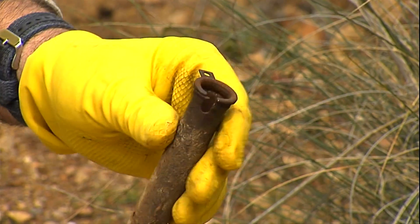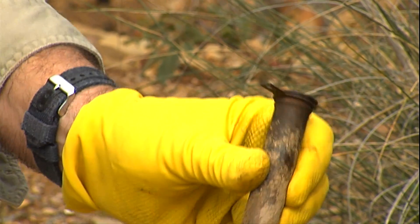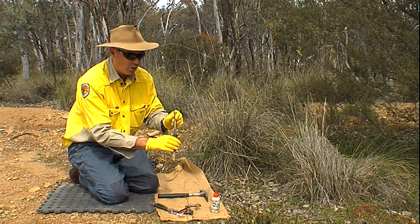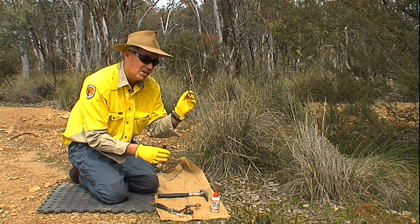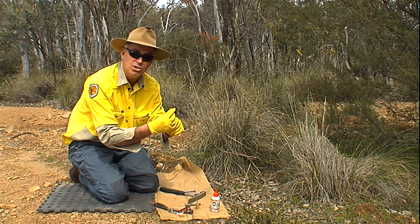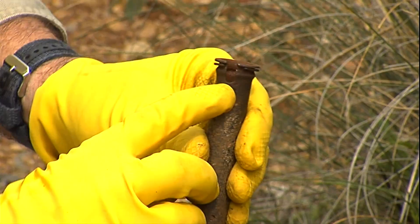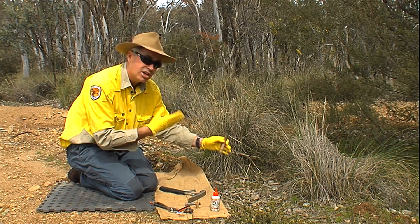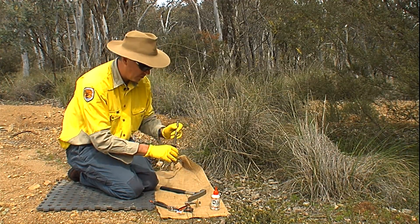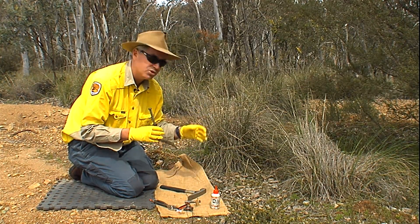Now we've got the stake with the locking ring operational. If you have heavy rainfall in your area, you can drill a few weep holes if you're worried about water filling up the stake. Always use a driving bolt — never hit the top of the stake directly or you'll damage the locking ring. We always keep that little notch or gate facing the operator so when you or someone else comes to check it, they know it should be facing them.